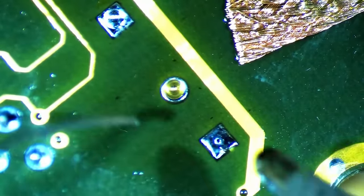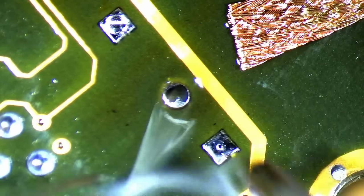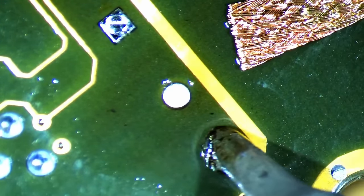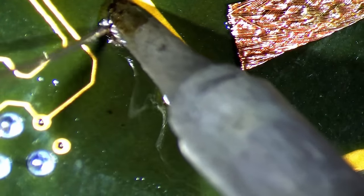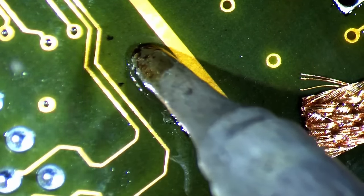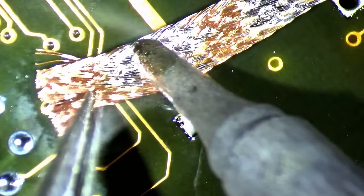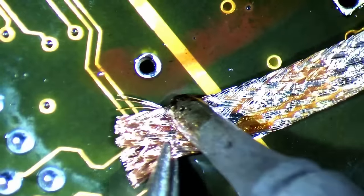After removing the old capacitors, we must prepare the board for the new caps by freeing the holes from the solder residue. I apply low melt solder and let it mix with the existing solder, but only to holes not part of the larger ground planes. That is because even with low melt solder, clearing holes connected to large copper planes is very challenging unless you're using a lot of heat. A wick in combination with low melt solder and flux works quite well on the other holes though.